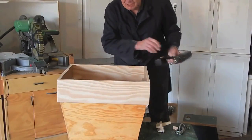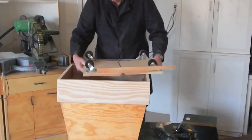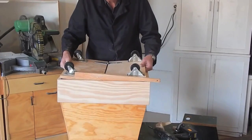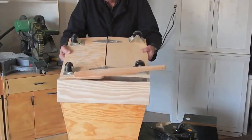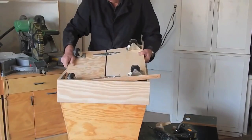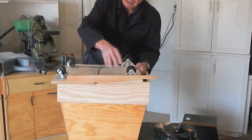I've just finished installing the two cleats. They serve a double purpose — they provide the pads by which the whole cabinet is jacked off the floor when the retracting casters are extended. Here's the setup for the retracting casters: two pieces of plywood. The front one is slightly shorter because of the arm attached with screws to the rear board. Swivel casters at the back, fixed casters at the front for a little extra stability.